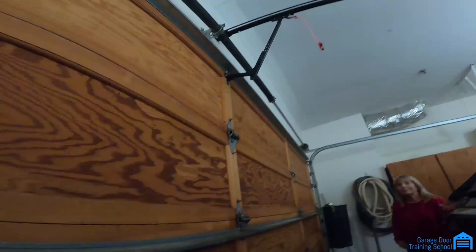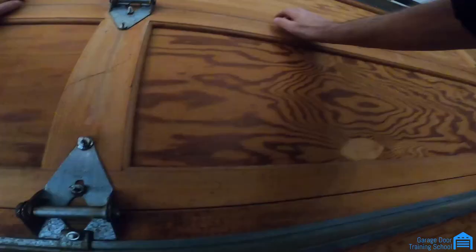The doors, these openers are designed to lift about 30 pounds. So when your door's balanced, it can lift your door. But right now, it's probably about 75 pounds for it. It felt heavier. No, it is, but okay. It's just these doors. You only got one spring pulling right now. So, but it'll be fixed today.